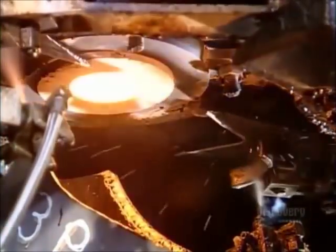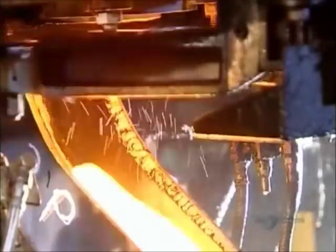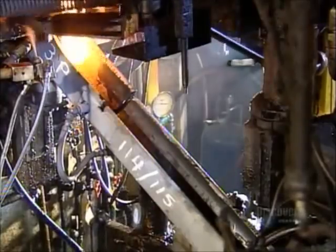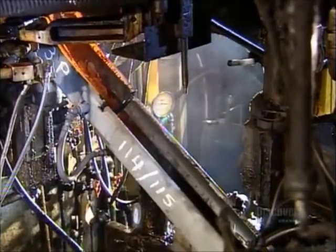The furnace heats the mix to the melting point, over 1500 degrees Celsius. It turns into molten glass that looks like lava. The glass, in this lava-like form, will spend up to 24 hours in the furnace. On its way out, mechanical shears cut it into gobs. The gobs slide down a water-cooled chute and drop into a baking dish-shaped mold.